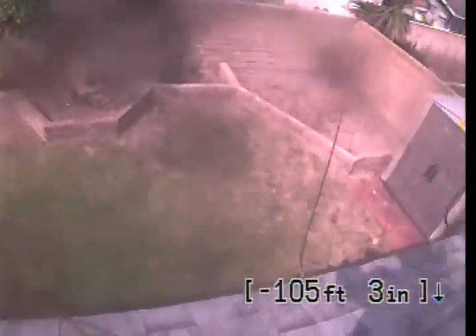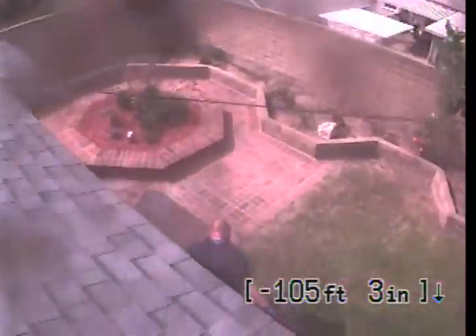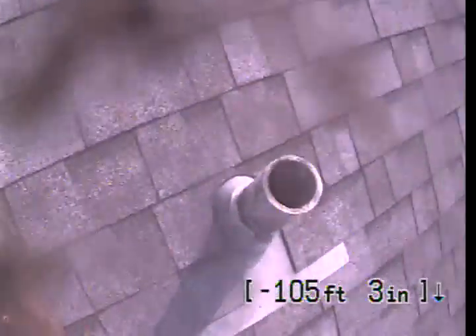We're going to show you a quick landmark. We're standing in the backyard next to this electrical panel. The lens is clean — there's the backyard so you have a landmark. There's the vent line, and that's the only access we had for the sewer line. We recommend a spot repair and also install a clean-out when you do the spot repair in the front yard.